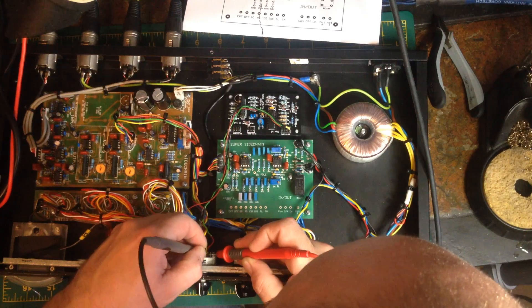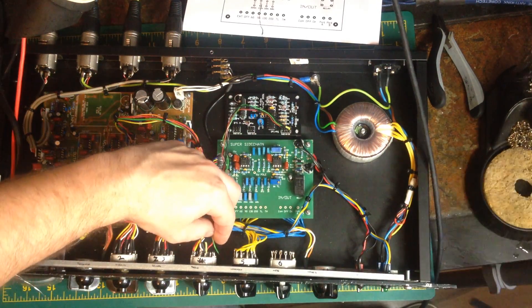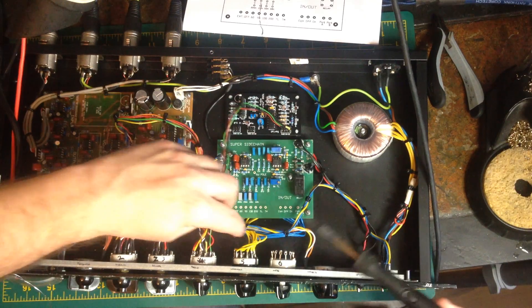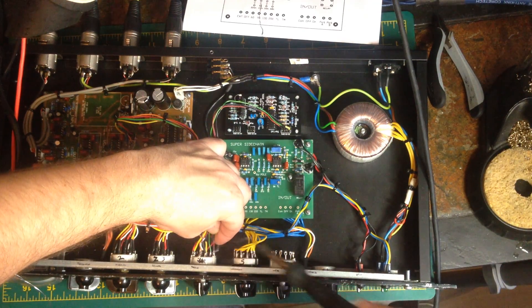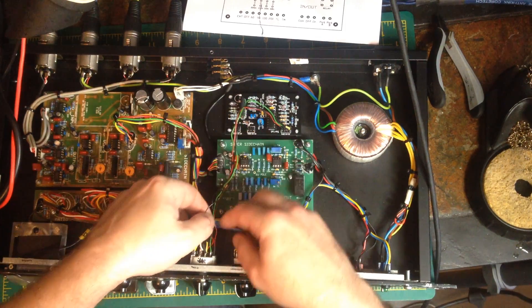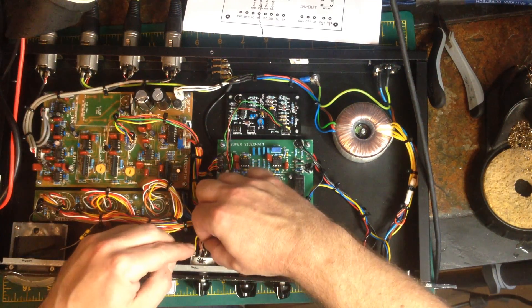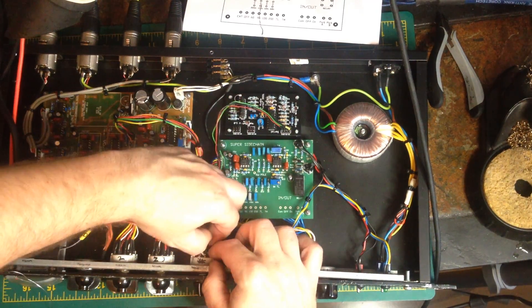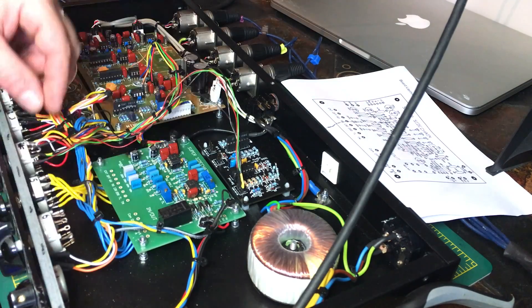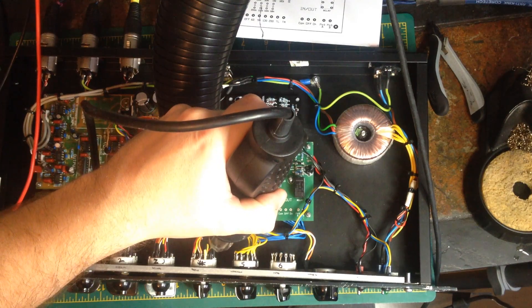It helps if you make a good connection on the pole switch. So now we know to connect the four to one to this terminal. And this will be ten to one — feel free to check it with the multimeter, although I know this is the one. I'll slide the heat shrink over the terminals and finally apply some heat to make it all look very nice.